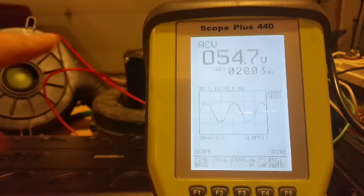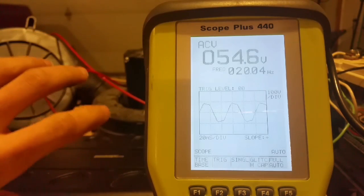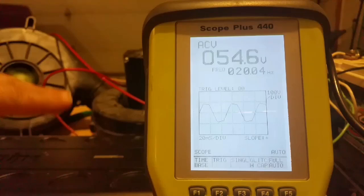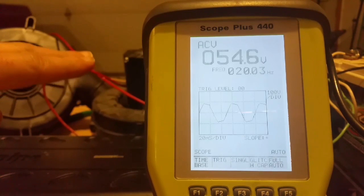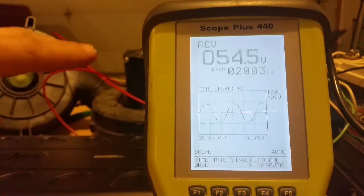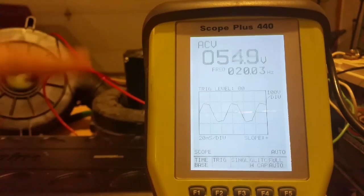In the case of the motor, it's turning and rotating, but it's actually temporarily stopping — it rotates a little bit and stops, rotates and stops. If this is your subwoofer or your speaker, your cone is moving up or out, it's stopping, turning into a DC signal and creating heat, coming back down, hitting a DC signal again and creating more heat. It just repeats: up, stop, down, stop, up, stop. That's where you get a lot of extra heat — and that's how you can fry your voice coil, break your tinsel leads, or start your cone on fire a lot easier and faster than with a nice smooth up and down motion.